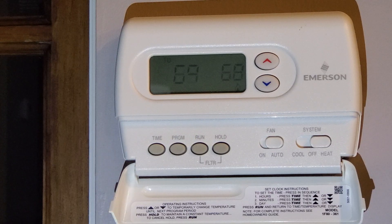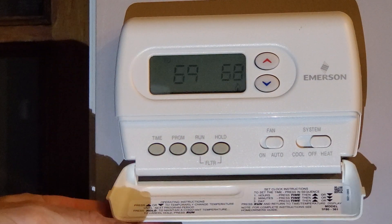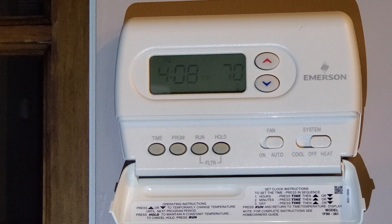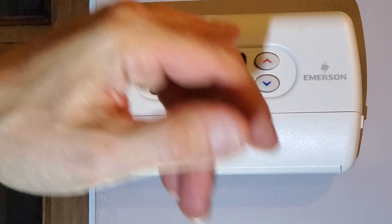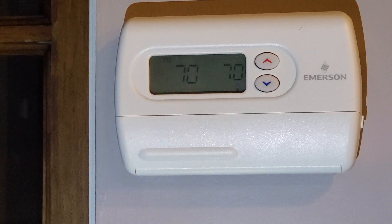Here's the cool thing about this thermostat. Right now I have it set, and if I'm feeling a bit chilly I can raise the temperature to 70. The room is currently 69 degrees but I just raised it to 70. At the next cycle — which occurs at 5 p.m. — it's going to go back to its regularly programmed temperature. So if you raise it during the day, you don't have to worry about going on vacation and it being stuck in that mode, because at the next programming cycle it drops back to what you've programmed. Hope that helps — sometimes you just need a visual to get through it. See you in the next one.